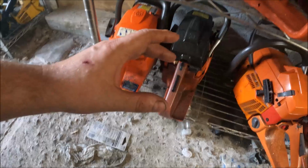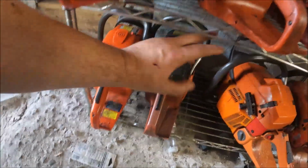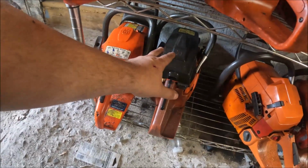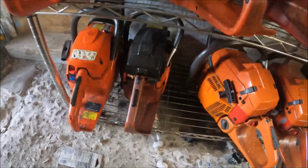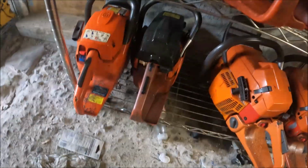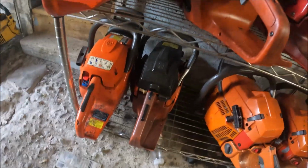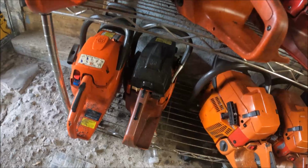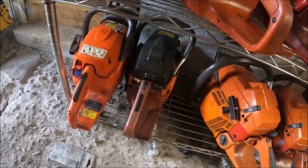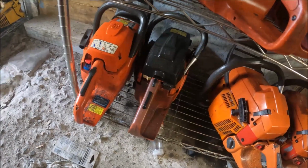A lot of guys do that in the 372 cylinders, but if you put a 365 special in these, you either have to cut the pop-up into the piston or do what I did on this one and cut a bunch of material out of the squish band. I'm thinking that saw has somewhere around 225, 230 psi. Good strong running saw, and it is a 48mm open port setup. It's running on a 272 carb. Lots of videos on the channel of that.